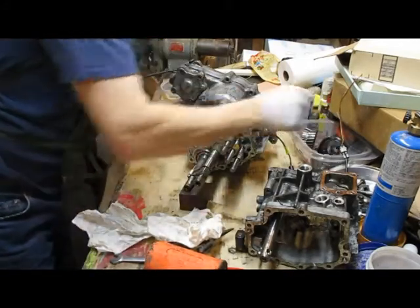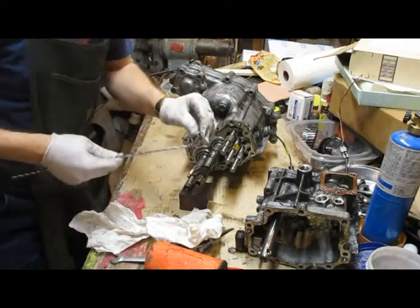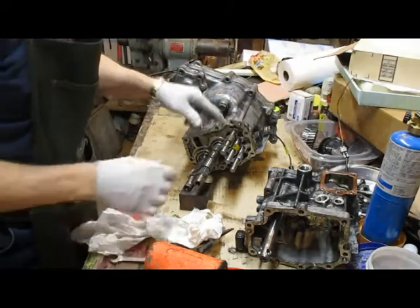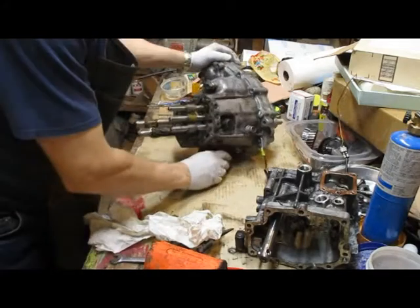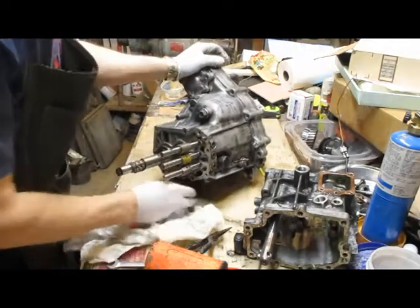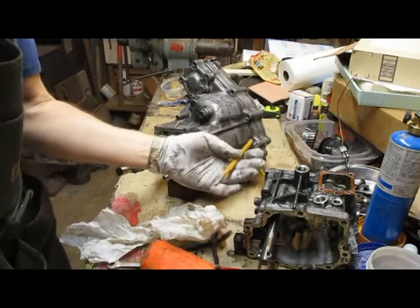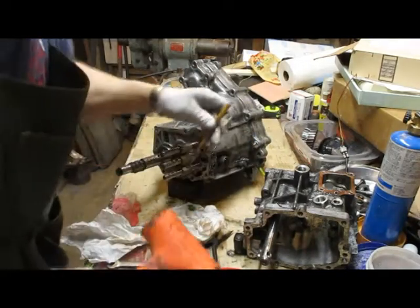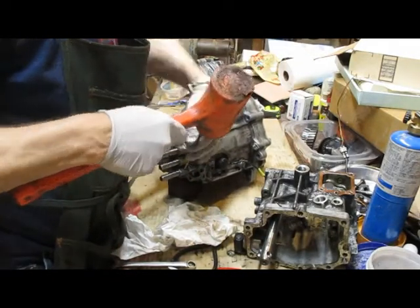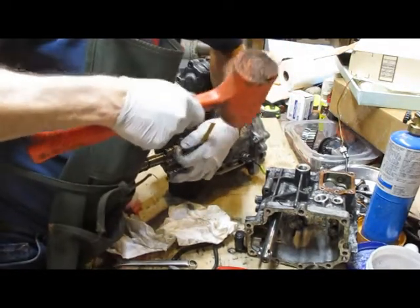That's what it looks like. And there is a ball bearing that needs to be taken off — three-sixteenths diameter roughly. Now we've got to get these dogs off of here. Dogs are held in with what they call split rings, and it takes a three-sixteenths punch — I actually had to sand it down a little bit. When you start knocking them down in there, I like to kind of support the shaft a little bit so I don't have to worry about the shaft getting bent.